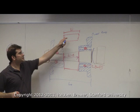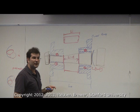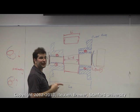If this is a really stiff material, then we can't have our minus epsilon and then we're not preloaded. Okay? What happens if we tighten the bolt on both sides with this in the middle? Great, it will feel tight, and then the entire assembly will shift, the entire inner race here, spacer, and inner race here will shift back and forth as if there's just one big bearing, just one outer race and one inner race. Everyone see that?